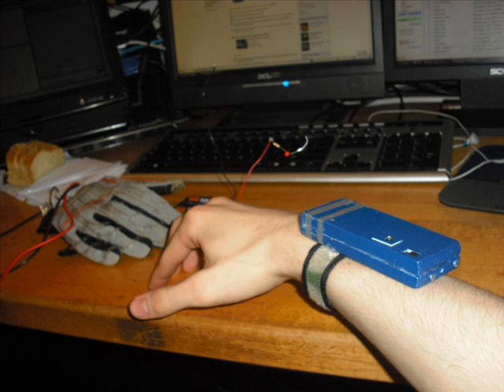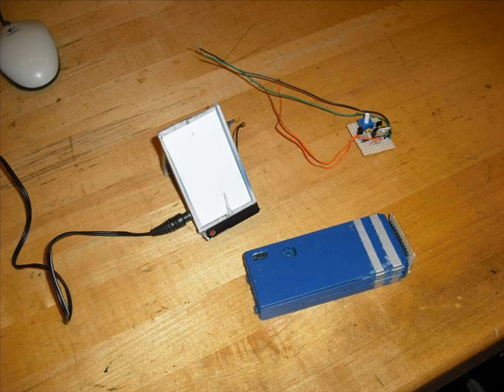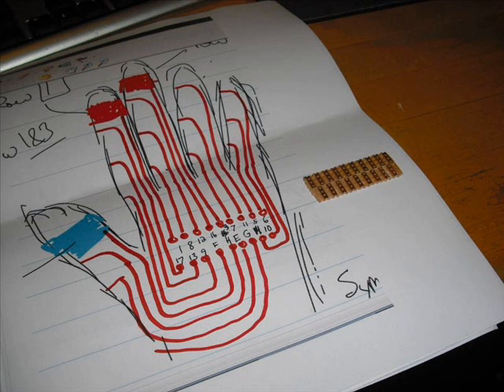Technical Details. The Data Glove consists of three separate parts: a Bluetooth module in the blue box on my wrist, the glove itself with conductive thread forming the connections and contacts, and a recharging dock for the Bluetooth module. The Bluetooth module contains the circuit board from a Dell Bluetooth keyboard, modified to be smaller and with a connector for the glove, as well as a 3.7 volt lithium polymer battery and an external connection for the charging dock. The glove has a flexible connector for the Bluetooth module connected to a breakout board on the back of the glove, to which all of the conductive thread traces are sewn.